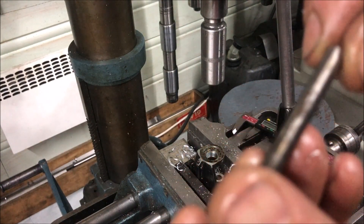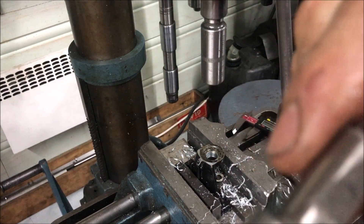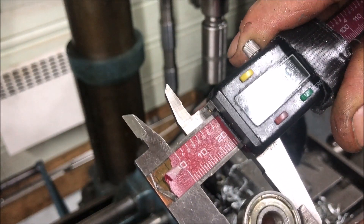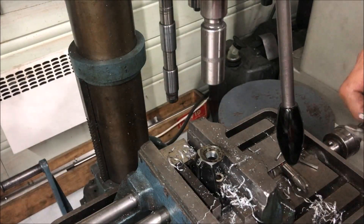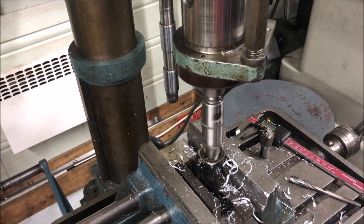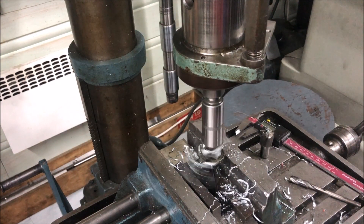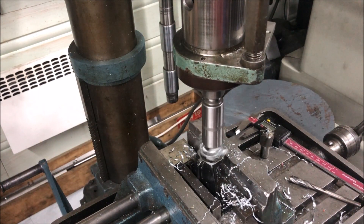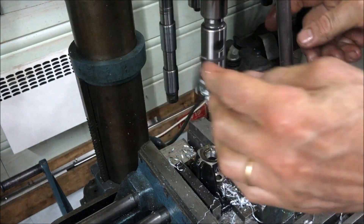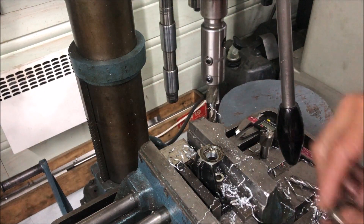And now I will need this 14 millimeter guidance here in the middle, and a cutter that is 22 to fit this bearing race here, which is a little bit shy of 22 — of 23. Center relieved, so to speak.